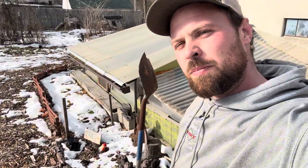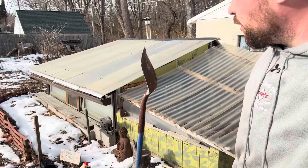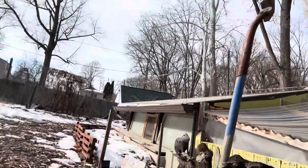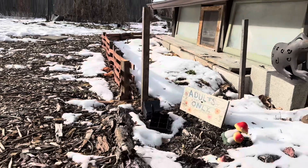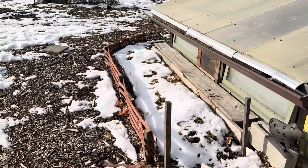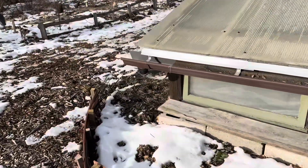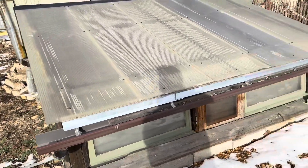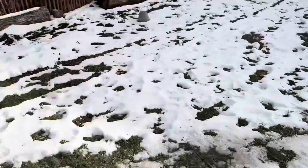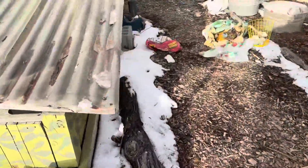When we dug this pit we dug into packed gravel and backfill, stopping at four feet. Maybe eventually I'll dig deeper to get a cold well going. In front of the greenhouse I built up a lot of dirt — you can see the dirt is humped up with strawberries planted there. That berm helps direct water around the greenhouse, and I have a berm here too. We've gotten up to four inches of rain in a day and it's never flooded — the most that's happened was maybe a trickle. You learn a lot about where water runs on your property when you do something like this. My advice: know your water table and pay attention to where water drains.